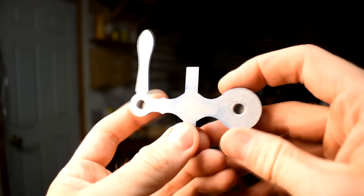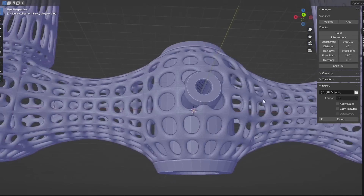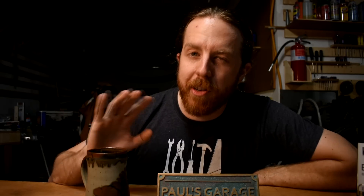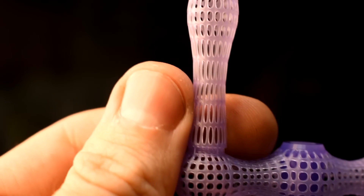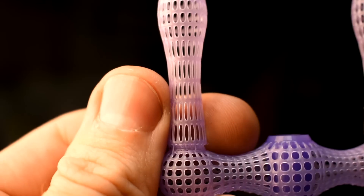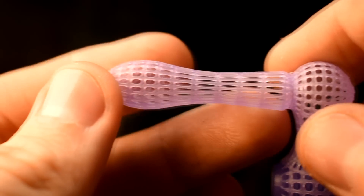But I figured, let's try investment casting the thing and use investment casting to my advantage and make it cooler looking. I decided a wireframe filigree thing looked pretty cool for no practical reason, honestly. I even added some thicker bits for the shaft and for the set screw. I was learning to play with modifiers in Blender, that's why it looks this way. This wireframe thing is super delicate. I printed it with no internal supports because how am I going to get them out of there? These are printed in layers, each layer cures to the release film in the bottom of the vat and it pulls off. That means every single layer — of which there are thousands — the entire print below gets pulled on. Casting resins tend to be brittle. What could possibly go wrong?